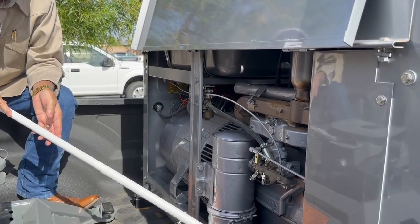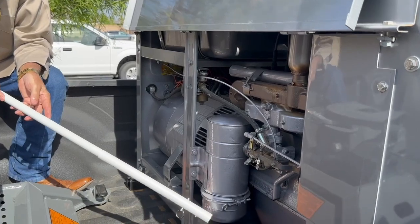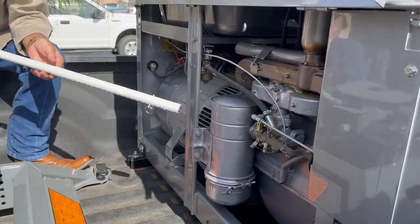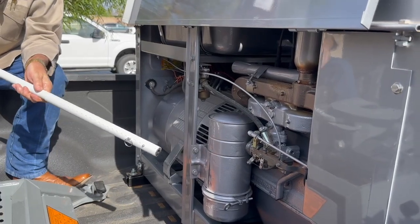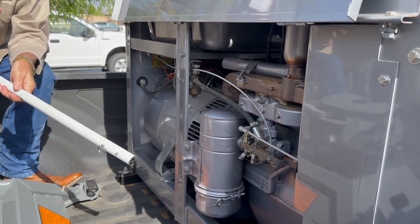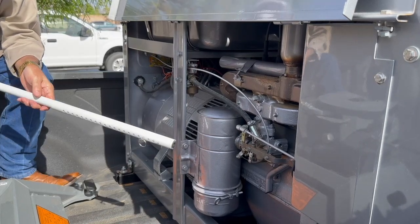This breather is not a paper filter — it is oil. You fill the bottom part of it with oil. The air intakes over here and is forced down on top of the oil. It bounces, kind of like a basketball, and it traps all the dirt. It's very efficient — it's a very good system.